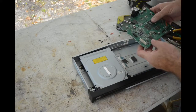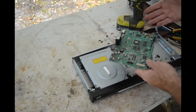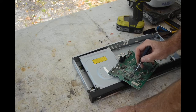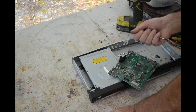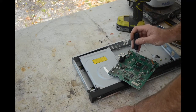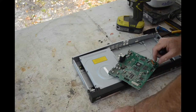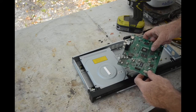It's a flip chip, and I have bad luck with flip chips — there's generally no gold I can find in them. Normally when they make an IC chip, they put the die in the center of the package and run gold bond wires from all the legs onto bond points on the die. But someone figured out they could flip the chips upside down so the bond points on the die touch right onto the ends of the legs — no gold wire needed. There may be a tiny dot of gold there, but really not enough to bother with. So I was hoping for a gold-corner BGA but no.